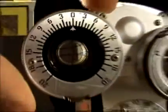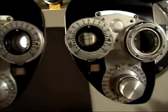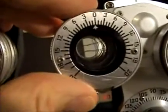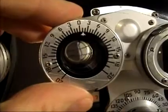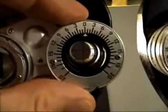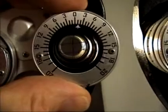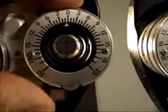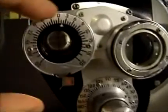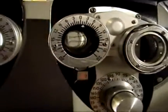At one or two prism diopters away from zero it looks like movement. At zero I think there's still some movement — it's difficult to see through a camera; you can get your eyeball right up through it for more accuracy. I found the zero point still has some down movement, whereas at one prism diopter in this direction it looks like zero, and anything away from that starts showing movement. So what I do is lift off the plate, rotate the gear by one prism diopter clockwise, and then recheck it.